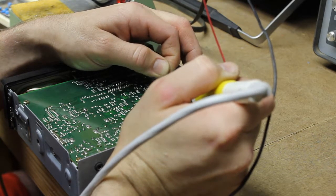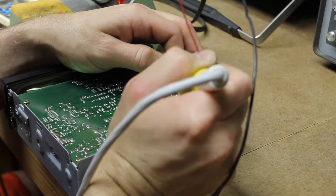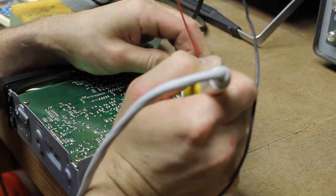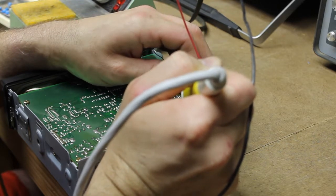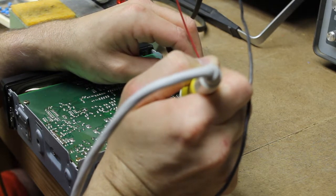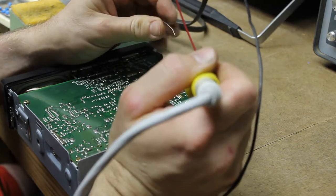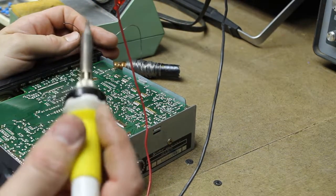On this daughter board, it looks like one of these terminals has already been re-soldered. This radio is one that I picked up at a garage sale many, many years ago. The issue with it — which was a quick fix at the time — was that the reverse protection diode in it was blown out. So I replaced it, and that brought it back around to working.